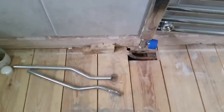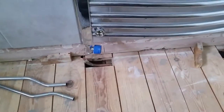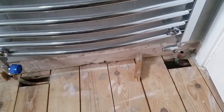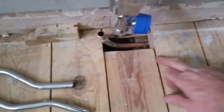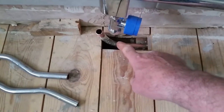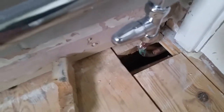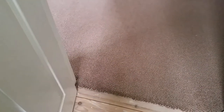I'm going to put chrome pipe up to them, but I have a feeling it may be a bit fingernail-biting. Anyway, that's the plan for this weekend. Today is the day for plumbing these — very kindly bent for me — chrome 15mm pipe. I need to attempt to fit it into the bottom of there and link up with these pipes. I'll cut out some more to get at it, try to get something fireproof underneath, and do the first joint here, possibly another joint there and across. To get this, you have to sand off the chrome finish with emery cloth. The one that concerns me is that there isn't a lot of room, and I think I'm going to have to go out onto the landing, take the carpet and floorboards up, and break into it somewhere in this region.